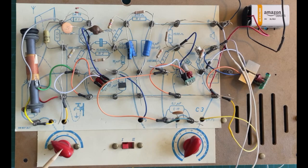Hopefully you've seen that the reflex AM receiver kind of starts out looking like a TRF set — just a coil and a variable cap — and that gets immediately amplified. But it goes further than that, and it's not quite like a regenerative receiver, because that first transistor doesn't get fed back more RF positively — it gets fed back audio. So it does double duty, amplifying both RF and audio within the same transistor, or in the 19-teens, a single tube. And I guess that's what makes it unique. Of course, it has nothing to do with heterodyne receivers, which have local oscillators and all that — that would presumably come later. Anyway, I hope you found this interesting.